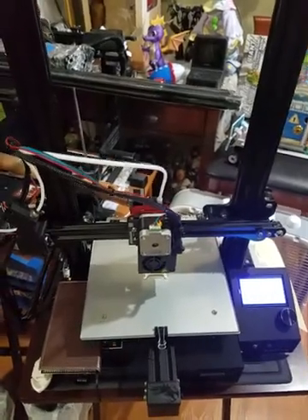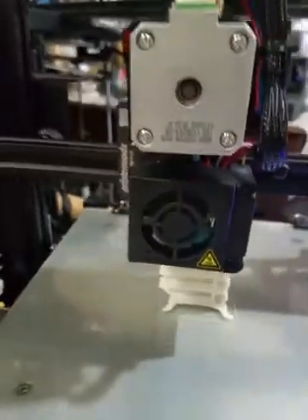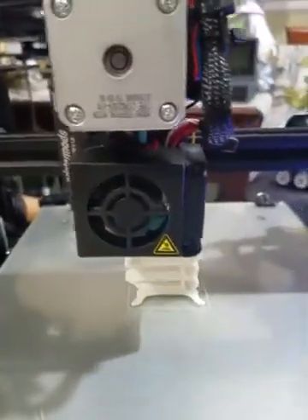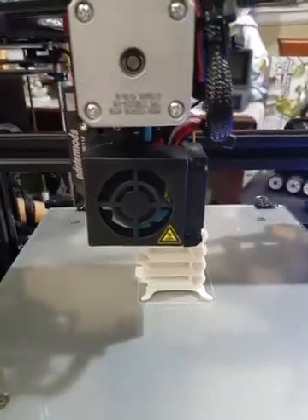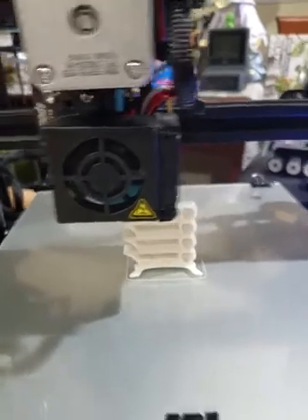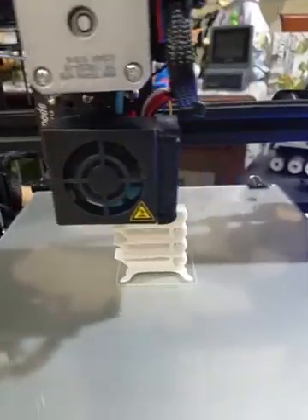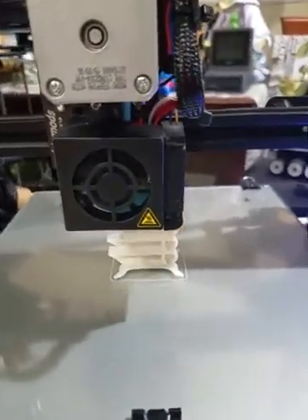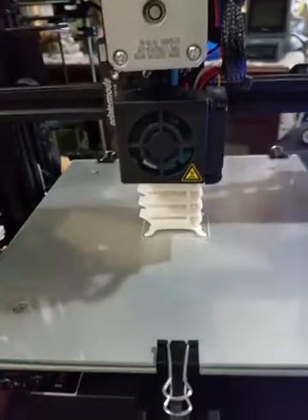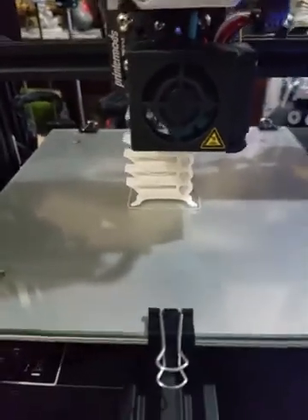So I looked at this fan here. As I looked at this fan — this fan is quiet, but it was going super fast. I took it out and checked the voltage. It's 24 volts — that's fine. This is a 24-volt system. I was wondering perhaps I might have had a 12-volt fan on this, and it was going super fast. Well, 12 volts could have burned it out. But as Murphy's Law says, if something's going to happen, it will happen.